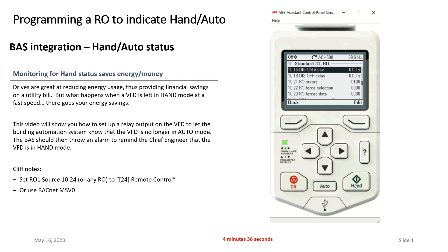I'm going to go ahead and run this in hand. You can see my relay right there — zero, one, zero. When I go to auto, that last zero — that's relay output number one on the far right — just toggled. So it's letting me know that now I'm in auto mode. But if I go back to hand, that relay is toggling to zero. You probably can't hear the relay clicking in the background, but when I go from auto to hand and you see that one go to a zero, there's a click in my demo — letting me know the relay is changing state. You can see that right here in the relay output status. So this relay output one was wired back to the building automation system. The BMS would know right now that it is in hand mode, and once it was in auto mode it would know that it was in auto, or as the drive calls it, remote mode in that parameter.